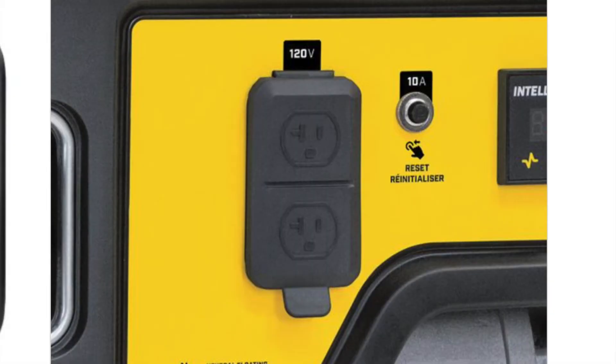A lot of the cheaper camping-type generators will only have a 120-volt outlet, because they're mainly there to supply a plug-in for an appliance you'd already use while camping, and then to turn off the generator when it's not in use. If you haven't bought a generator specifically to back up the power in your home, it's probably not going to be a direct replacement for what the utility already provides — it's more of a band-aid solution to get you through the time when the power is not available, so that your pipes don't freeze and nobody suffers hypothermia or those kinds of things.